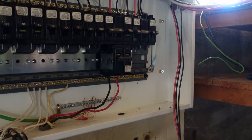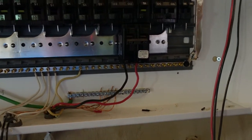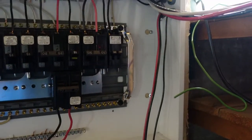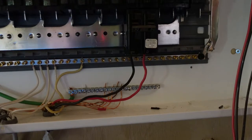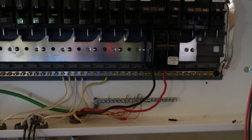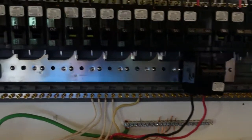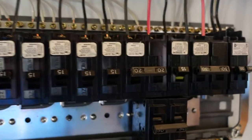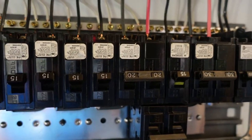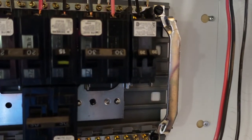As you can see, he's done that quite quickly — that's just how fast it is. It would be the same thing with this double pole 20, or this 12 gauge wire going up underneath that breaker. Along the top here we have a double 20, then all your single poles, then another double 20, and another double 30 — that one's actually for a wall oven.